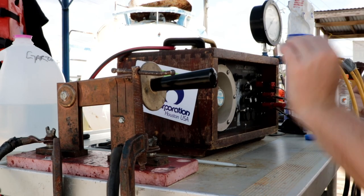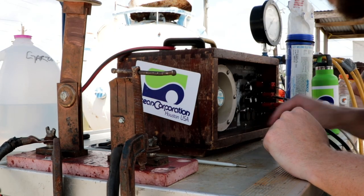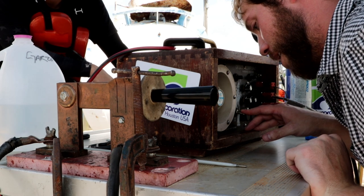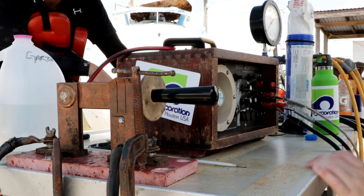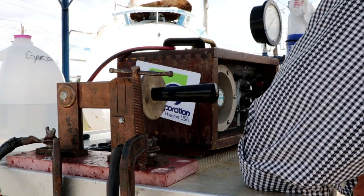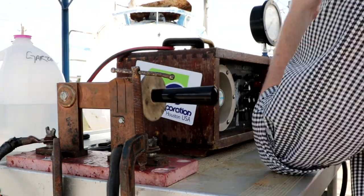The way it works when you're welding underwater: there's a guy on the surface that turns your power on and off with a knife switch. When you're not welding the switch is off, and when you're ready to strike your arc you say 'hot' and the guy you're communicating with on top switches it on. When I stop welding I say 'cold' and he turns my power off.